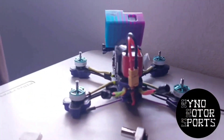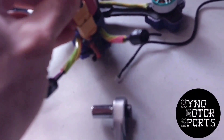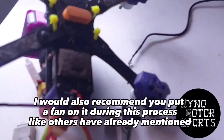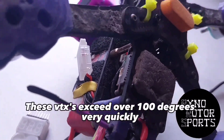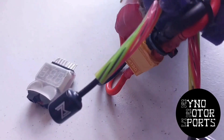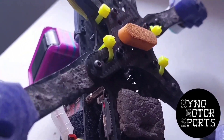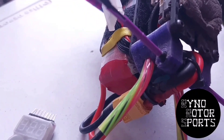It should pop up somewhere on the computer — yep, there you go. We are safe to un-power the quad and unplug. Now for the actual updating process: plug it in, it has to have power. You should be getting a blinking green light. From there you go ahead and hold the button — it's kind of hard to see, but hold it for 8 seconds. The light will turn off indicating the start of the updating process. During the update the light will blink red.